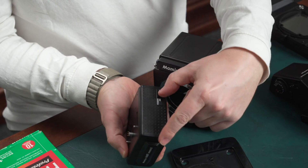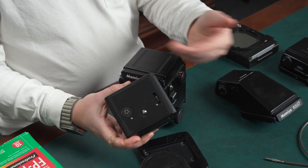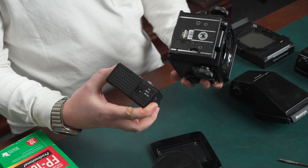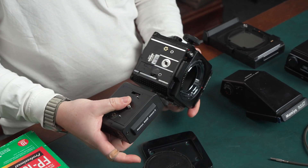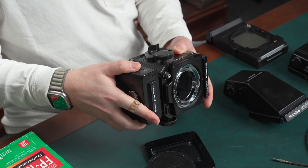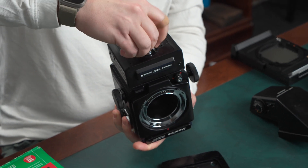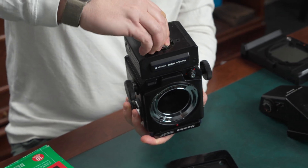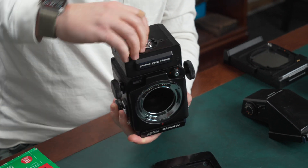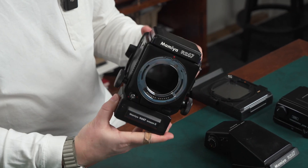The motor winder has an on/off switch. When you load the camera, you press start and it will advance. It also has the option to choose what kind of batteries you're using — you can read the manual for that. It has two locking pins and a screw. You see the holes here — you just put that exactly there. Now you have this grippy piece that you can twist. You want this tight because the winder uses the gears to move the camera, so you don't want any wiggle room. Theoretically you can turn it on and nothing should happen.